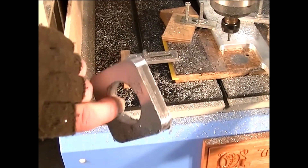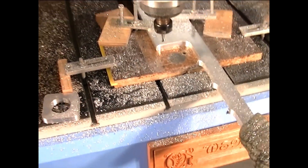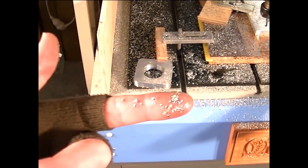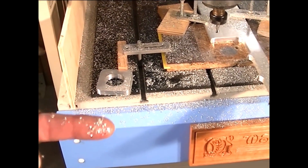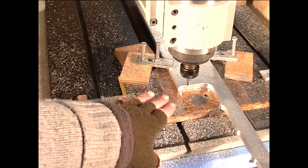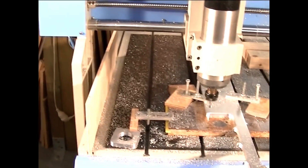It's got a couple of burrs on the edges, but it's very, very clean. You'll notice that the shavings that come off these CNC routers, when you run them at the right speed and the right feed, the shavings come off cleanly. But you do need to evacuate them with either air or a vacuum — I prefer air because it keeps the material and the tool cool. Plus I use WD-40 as a lubricant and cutting aid, and it makes a great one too.